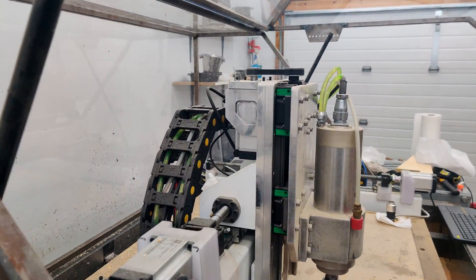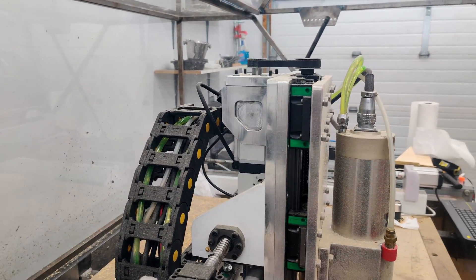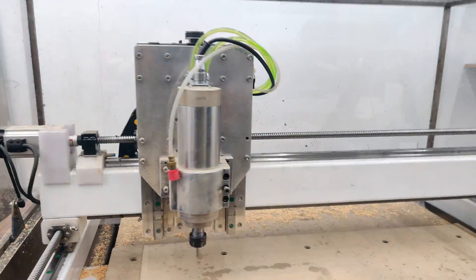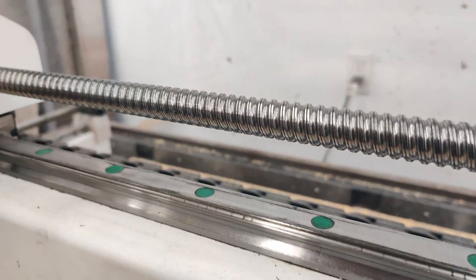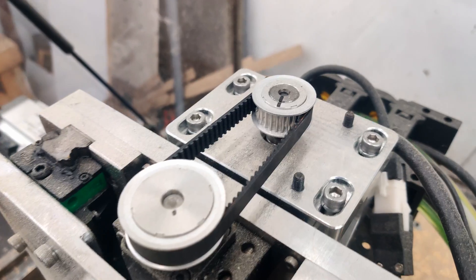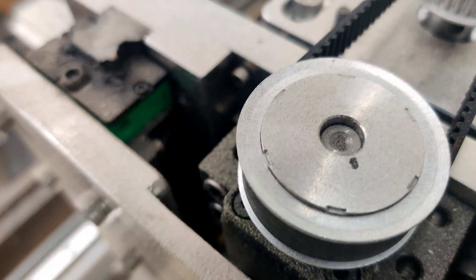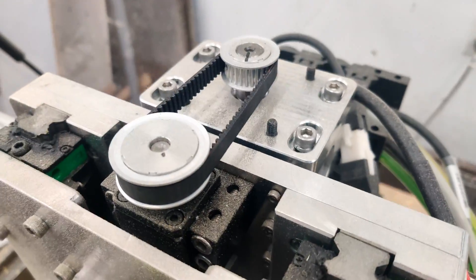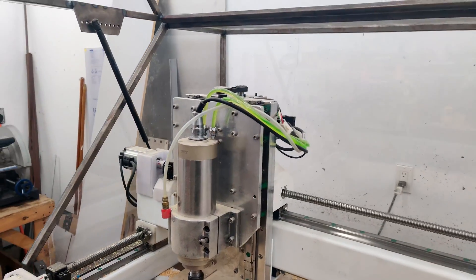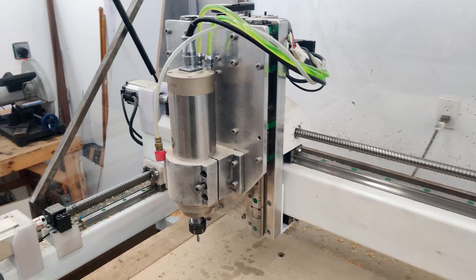These servos can go up to 6,500 RPMs, and that's what I'm running. This is running a 1204 ball screw, and this other one is a 1610. Another thing is I've had no slipping of these pulleys — this one's kind of worn off, but these pulleys have not slipped at all, which is great. I have nothing but two little grub screws holding them down, and that's with all that acceleration. Here's that G-code running again from closer up.